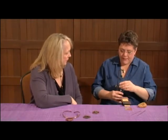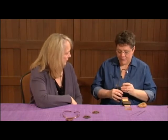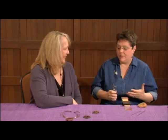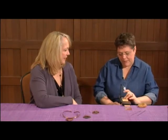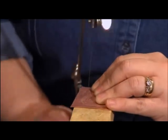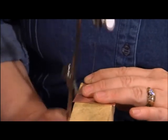What you want to do is be in front of your bench pin. The key to this is to hold your saw frame very, very gently. I tell my students think of cocktail hour - pinky up - because if not you'll get it in a death grip, thinking 'it's metal, I've got to really work.' And you don't. So you start at a point, get your first cut, and just very lightly use all of the teeth from here to here. Once I get going I put one finger behind and one finger in front - that stabilizes my metal.